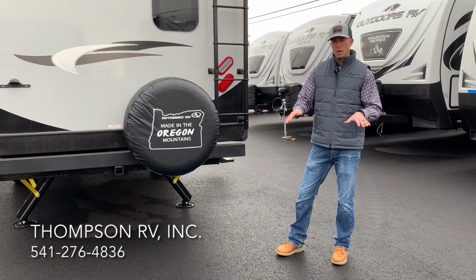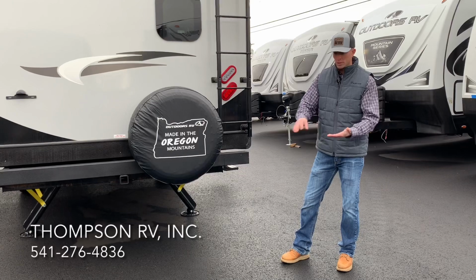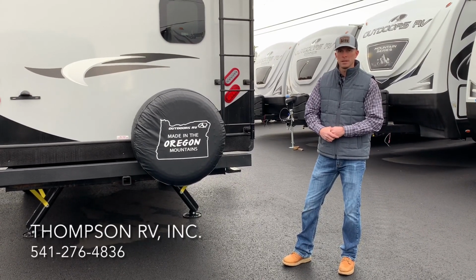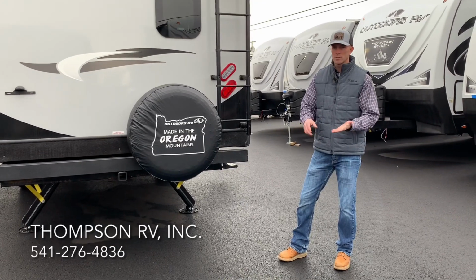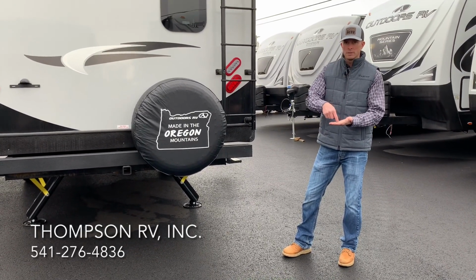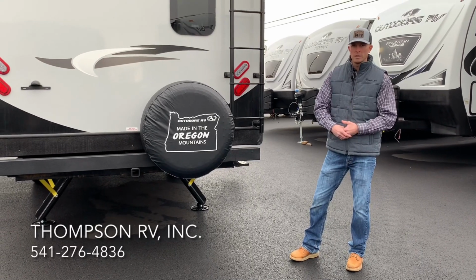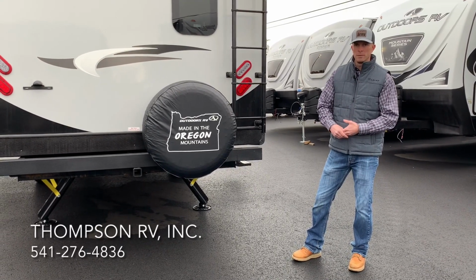We do not want water to get inside, so we're going to jump up there. We'll look at that Dicor. If everything looks great, we'll wait another 6 months and hop up there again. If there's a spot that's somewhat questionable, we'll dab a little Dicor on that spot there and let it sit. We don't have to cut the old stuff off or anything fancy. We'll just dab a little more over the top of it.